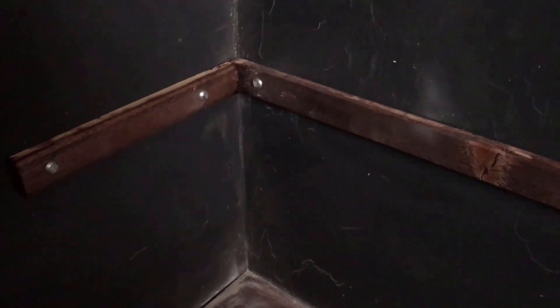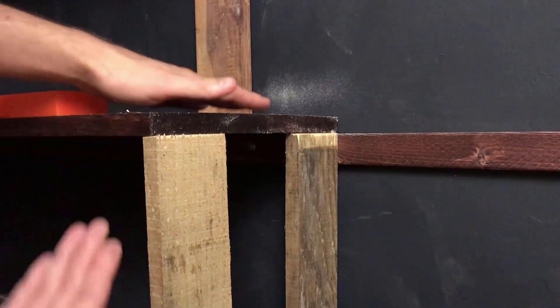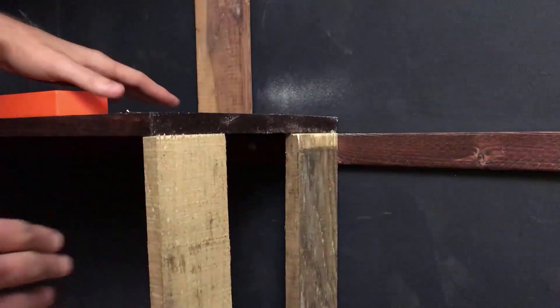Here I am in the corner of the board game shelves. As you can see, drilling out all these holes is a dusty process. Basically, you can see I'm building a little ledge, because then I've got the boards going to go in right on top of it. And then of course there's going to have to be a piece over there to support it, but then I'm going to take the nail gun and I'm going to shoot nails down in here, and that's going to keep the next shelf up. I'm just going to repeat this process all the way up to the top.